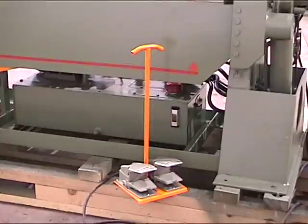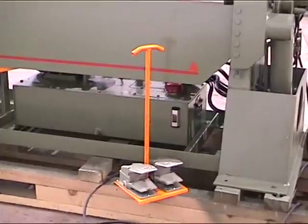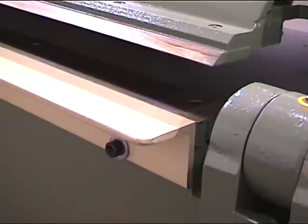The machine is equipped with two foot pedals, one to unclamp the top leaf. It is also equipped with an angle bar for maximum forming capacity. It comes with a replaceable bottom bar, and there's a half inch insert bar. The nose bar is removable and can also be purchased in a radius.